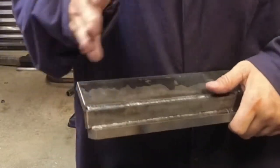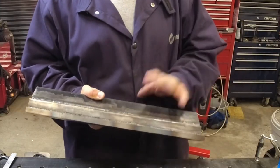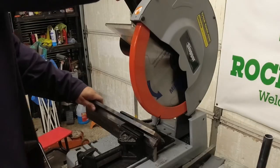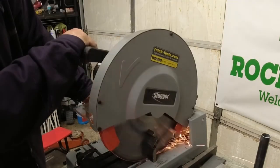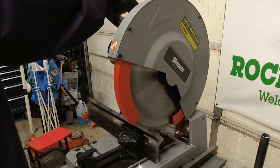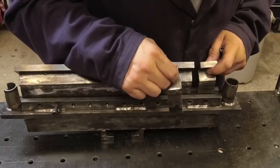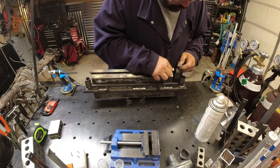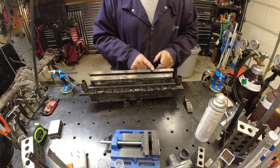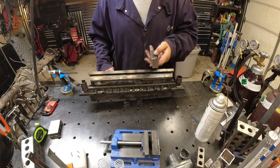Now we're going to slice it up into a few smaller segments and leave a larger piece for something later. We'll get it cut up, get this thing assembled, and do some bends. We'll go one inch and one-and-a-half inch. If I want to run just a single segment I'll stack that up under one of these screws. That way if we want to bend something custom I can cut fingers to different lengths out of this bar. I've got a one-inch and a one-and-a-half ready to go. Let's try a different spring setup.